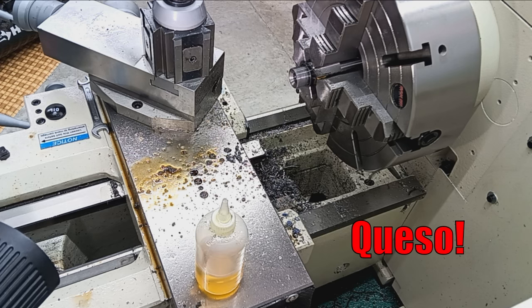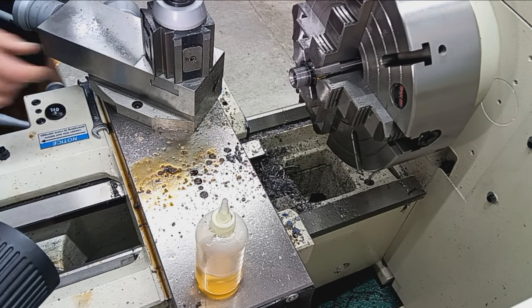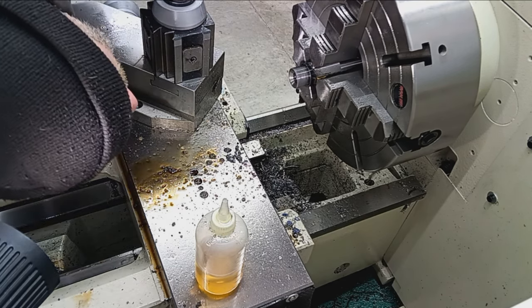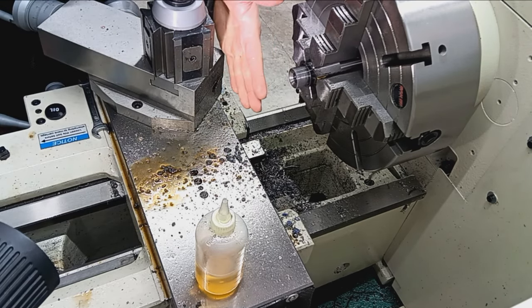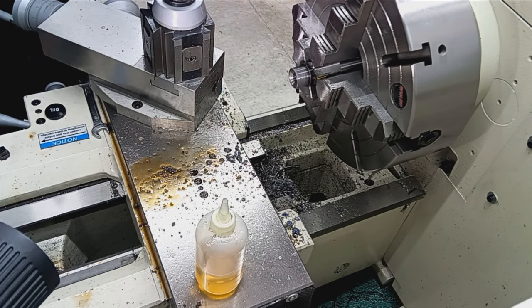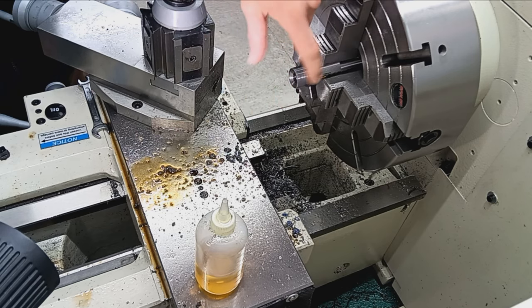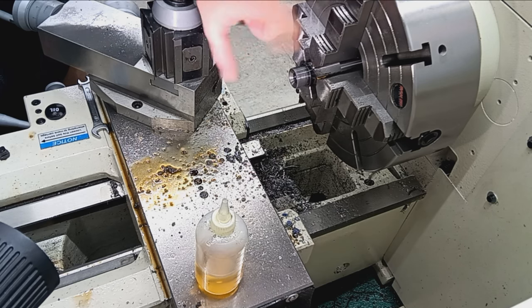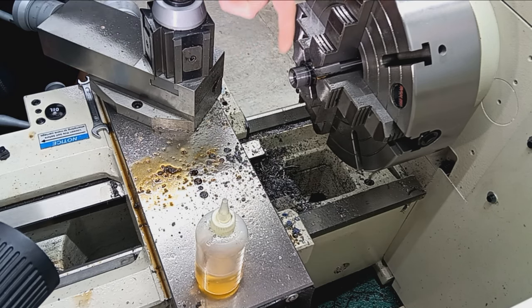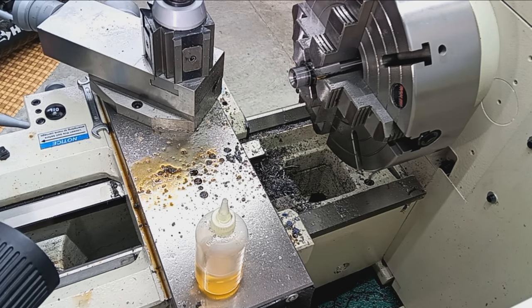Okay, so I'm not going to bore you with all that stuff, but yeah, this breech work is very, very close to being complete. Like I said, all I got to do is polish, and we'll be good. We can take it out, test fire it, check that, make sure the case looks good as it's fired, measure it, make sure it's not oversized in any area, oversized in diameter or length. Obviously, length is not going to be oversized because minimal headspace.